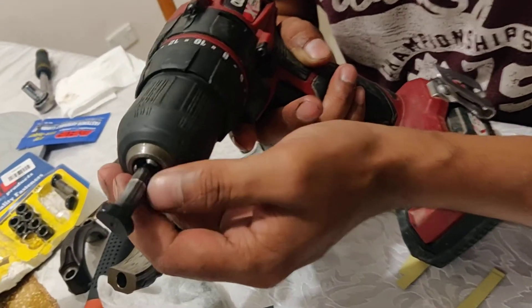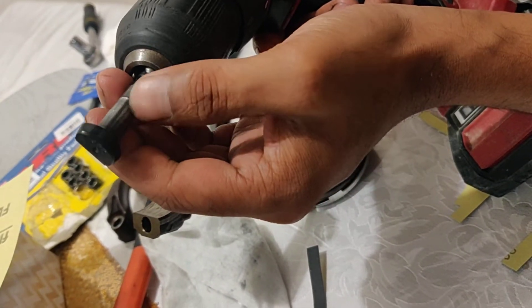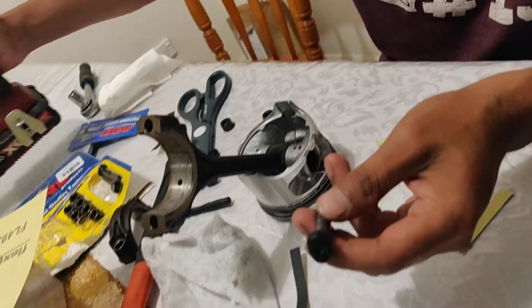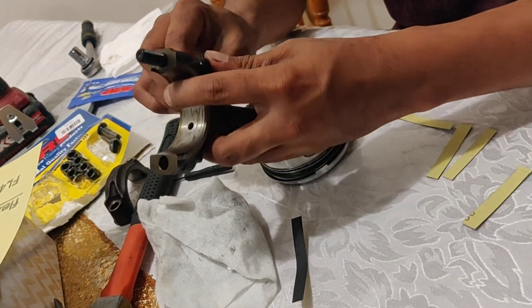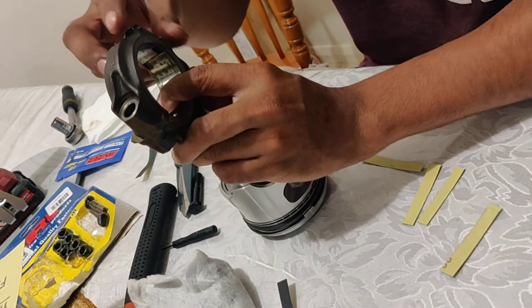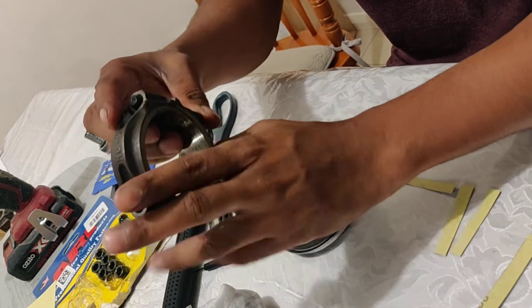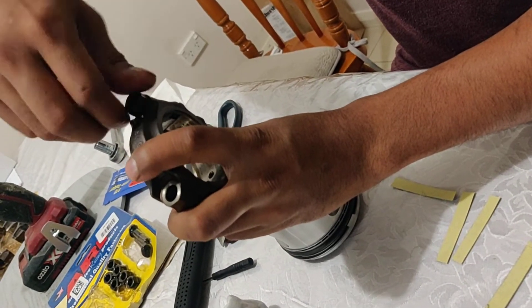You can see over here — this is where the taper is, you can see that line there. I actually need to take off more material so that taper flattens out. Be careful, you don't want to take off too much material, so it's a good idea to periodically put your bolt in and check.